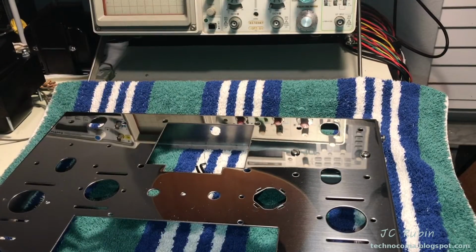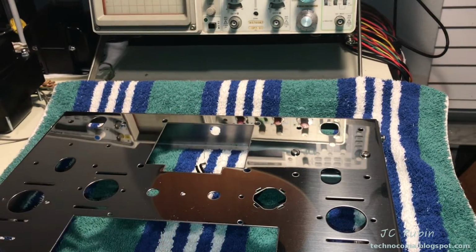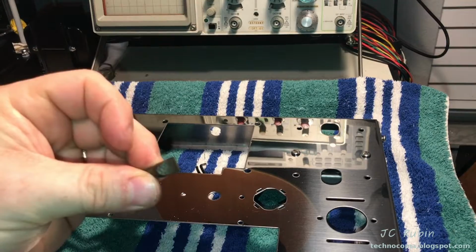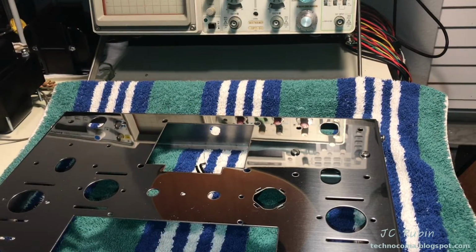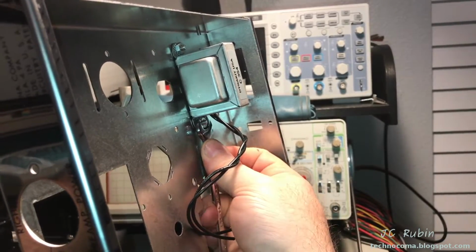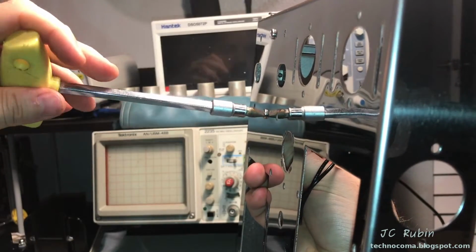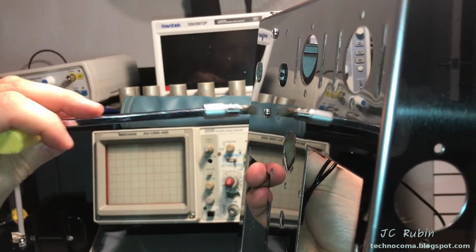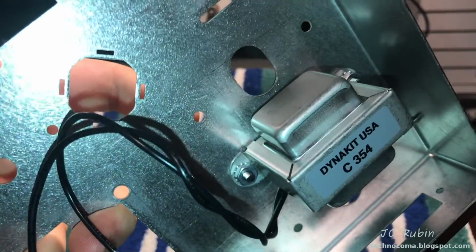For these larger ones, for securing, you should be using an 11/32 on the nut, unless you can't find your bit, and I guess you could get away with a 9mm on the inside. Also, I have a larger screwdriver bit that I use that is sized for these particular screws. And the standard procedure, lock it down on one side and tighten it on the other. With everything tightened down, the first piece is officially installed in the amp.